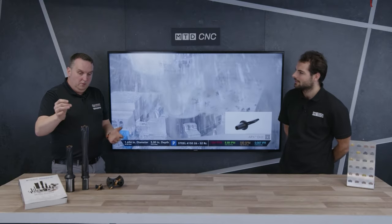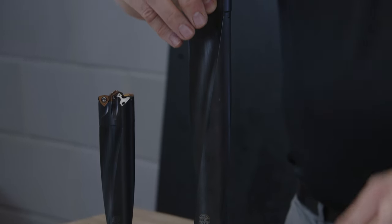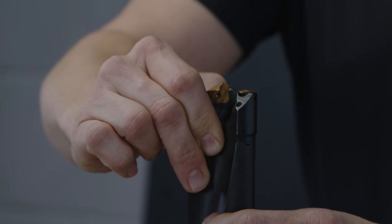If you're trying to rip that material out, one of the major problems is the centre point. The centre insert is the pilot insert — centre to drill, outside inserts cut outside to inside, the centre at really low RPMs. That's where people have problems with this sort of drill — it's the actual wear on the pilot insert, increased wear due to low speed.